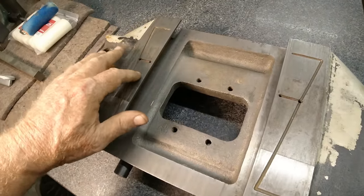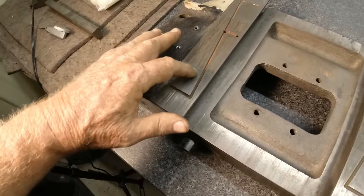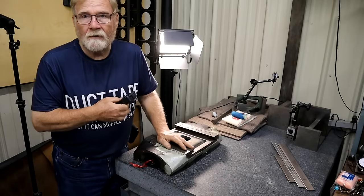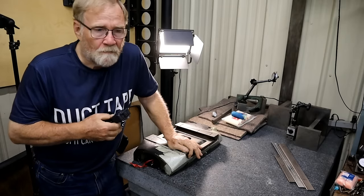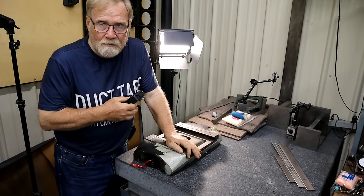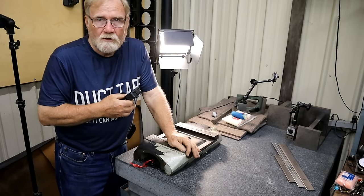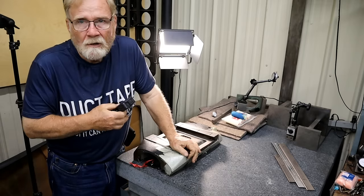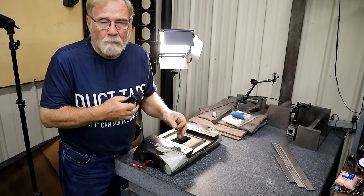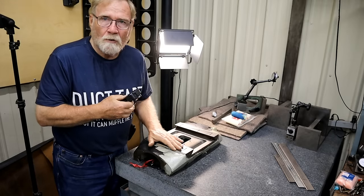So, being lower, also more oil pumps up in through here. And it gets wiped off by this little section here a little bit, but it's added back in. Now this section never ever sees the light of day, if you will. It's always covered. The rest of the kneeway is exposed. And that's why I don't like to see flaking down there, because grit just gets in there and sits. You know, think how many chips that poor machine has to make in its life. And little small tiny particles can get into those flakes. This is where it really needs to get its oil.